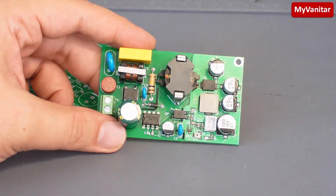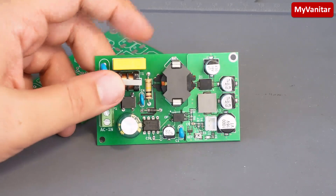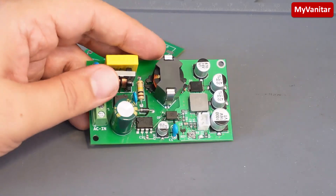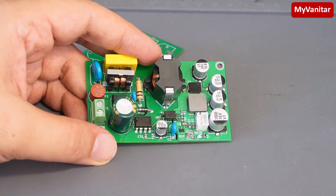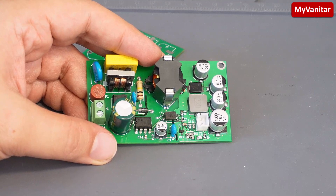The major difference between this design and similar ones is, first, this RM8 core, and second, the output voltage which is 8 volts. Later on I will tell you why I selected 8 volts for the output, not 5, 9, or 12 volts — the traditional voltages.